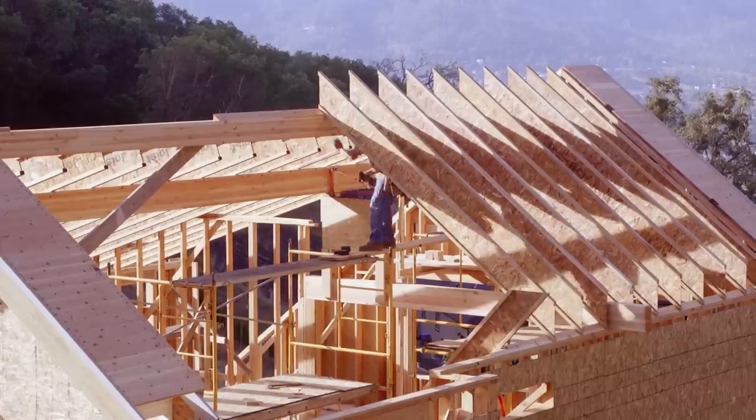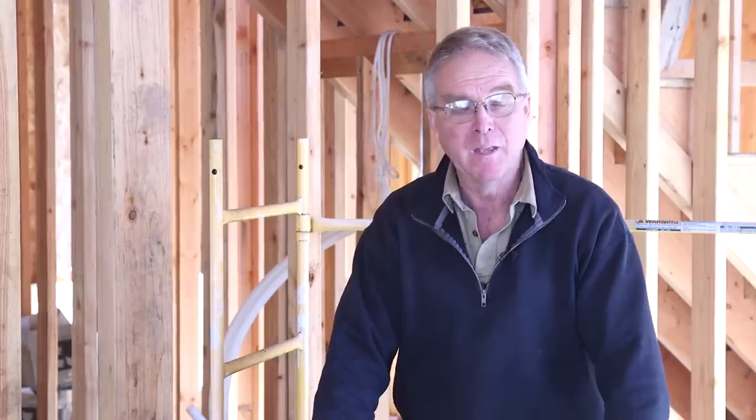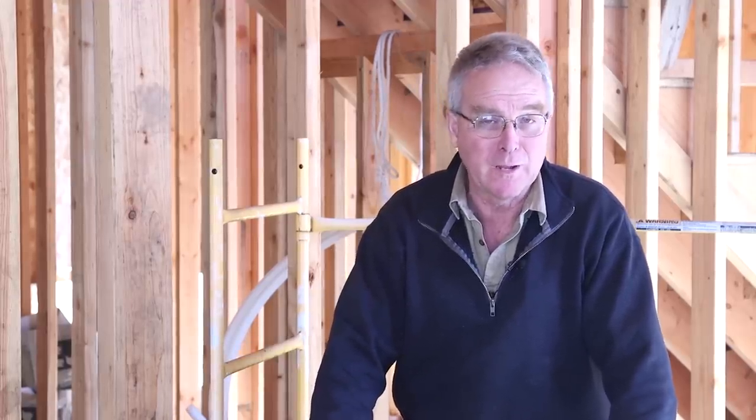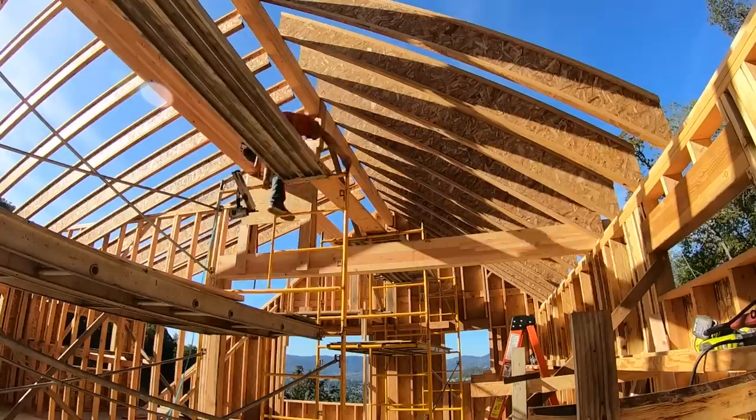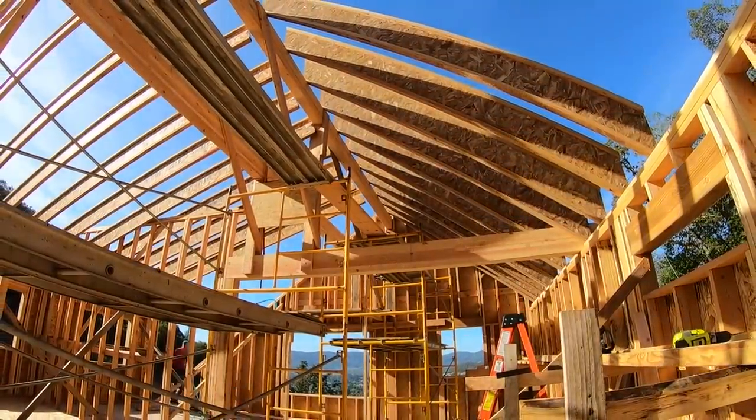Welcome back. If you've watched the last episode, you're beginning to understand that this roof system is kind of a grab bag of different procedures and different parts of the building. We can't just start on one end and take one process all the way across the house, so it's going to require you to keep track of what we've got going on. What you're going to get a look at today is something I've been anxious to start on — extending the overhangs at the sidewall of the house to echo what we established on the gable ends just a few days ago. You're going to see a big transition from the engineered wood products in the rafters and roof sheathing to good old-fashioned Douglas fir free-of-heart center beams on these overhangs.